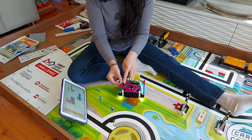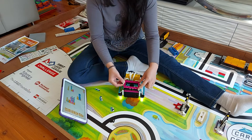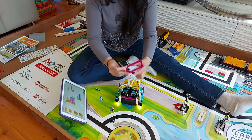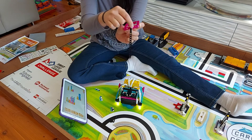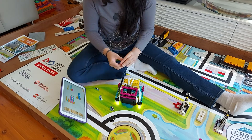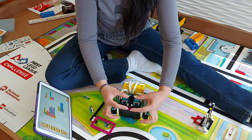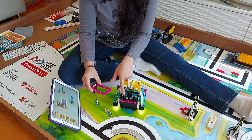I've tried it both with the mini black gear and this bigger beige color gear — they both don't lock in very nicely at all. This one doesn't even touch, so it can move freely. I feel that we need a hole at a position in between the two existing holes, but it doesn't have that position. So I thought we might want to try to shift the whole frame one stud forward so that this gear will sit in the right position to mesh with the PTO.